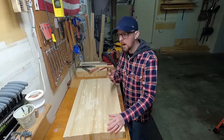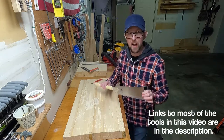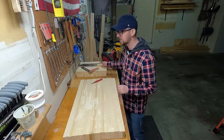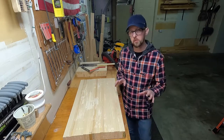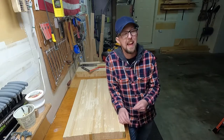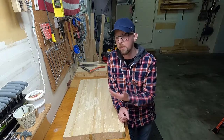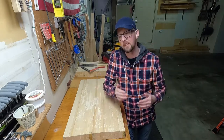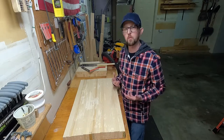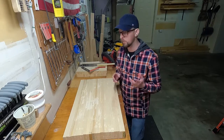Today we are going to use a square, a straight edge, a marking knife, and then eventually my Japanese pull saw to flush cut the edges of our two slabs — the top and the bottom — in order to figure out just how long this table is going to be. Whichever slab winds up being the shortest determines the longest length we can have, because I need the top and bottom to be the same length. When we start doing joinery with the side panels, we'll need them to not trapezoid in or out. I'm not an expert woodworker — just a person with a few tools who likes to build things in his garage.